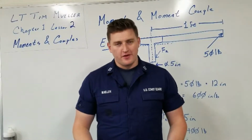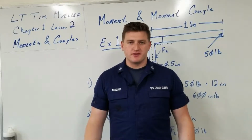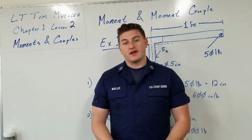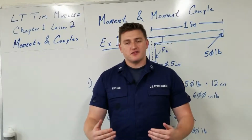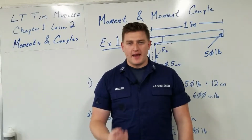Now, if you've been following my other videos, you've probably gotten pretty tired of me talking about moments and moment couples all the time. You're probably wondering, what does this have to do with ship stability? Well, we're going to start introducing in this chapter righting arms and righting moments. And then from there, we can actually look at something called the metacentric height, GM. And that's going to give us an initial number that's going to say if we are currently stable or unstable. But for now, let's go back into moments.